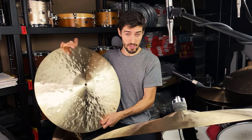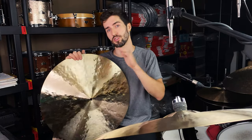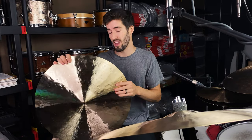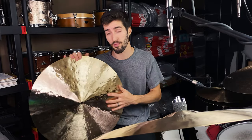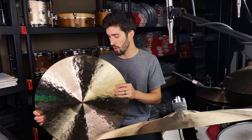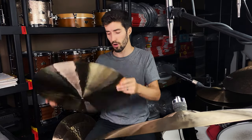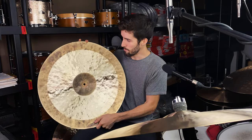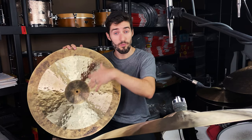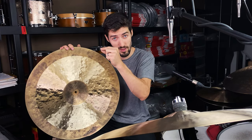There are many factors that go into making a cymbal sound a certain way, but one of the biggest factors is just the shape of the cymbal, the shape of the bell, the shape of how it curves to the edge. That is a huge factor, and you get the shape via the tensioning you do with hammering and or lathing. So the other thing that's unique about these cymbals, that's pretty similar to the way Bill's cymbals are, is the underside here. You can tell this section on the edge and the underside of the bell has been left unlathed. You first get them into shape with the hammering, and then with the lathing, you're shaving away that oxidized crust that forms on the outside of the bronze.